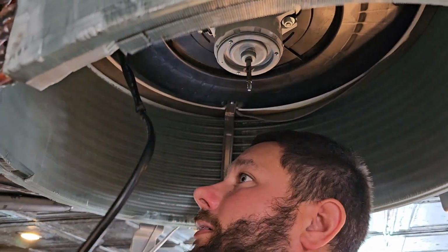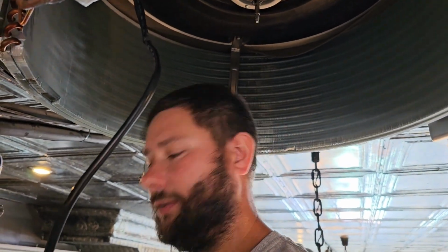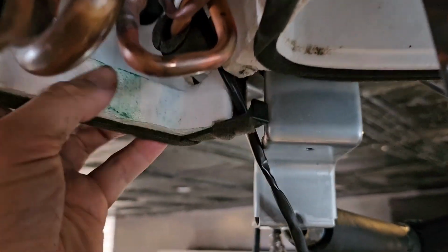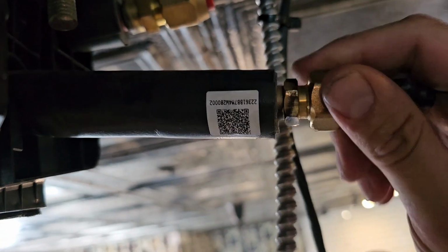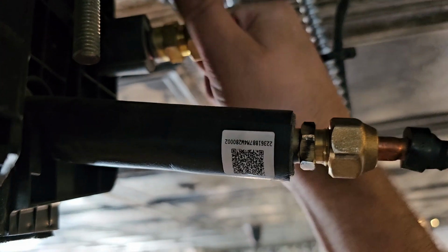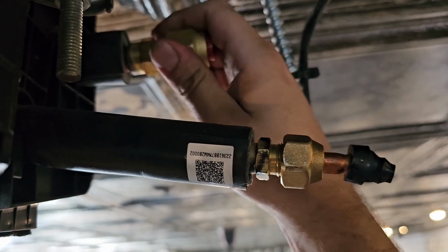All right. Make sure you have somebody to help you get this coil up here. Make sure you get it lined up the way it's supposed to go. Make sure you put the corner piece in. See, it goes right here. All right, got these connections loose. There's pressure, that's good. Means this coil is probably not leaking because they put nitrogen in it.